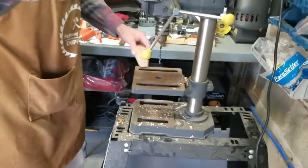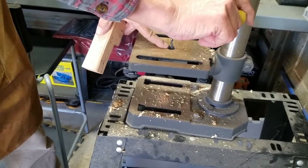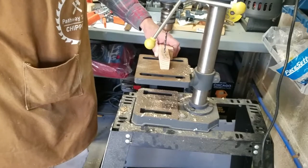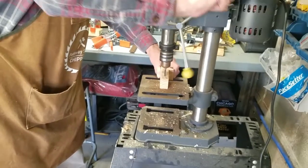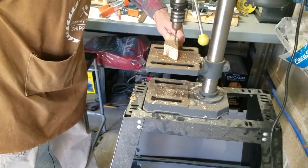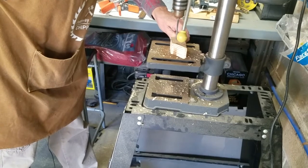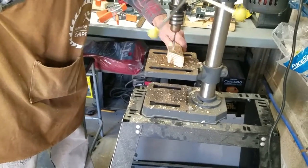I've got this lined up already. If you look down here, there's a hole in the middle of the drill press table — we want our drill bit to go through that hole so we don't ruin the bit by hitting the metal piece underneath. I've got that preset, so I turn this on and drill all the holes through. Now we have a place for our axles.